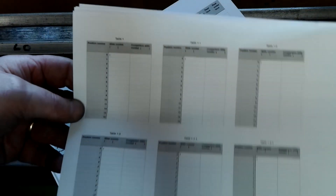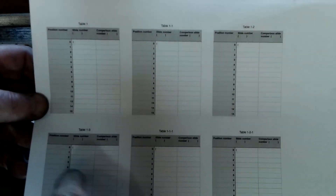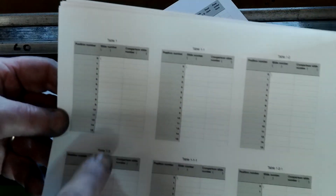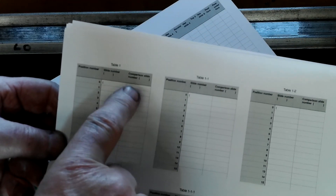So that I didn't lose track of things I put together a bunch of data sheets to record measurements along a given face and from what face the measurements were taken. All the other slides were then measured relative to these two parallel recesses using a simple method of linked parallels as a base for the mag mount and DTI.